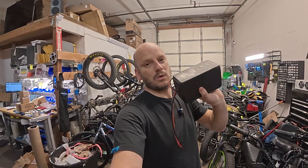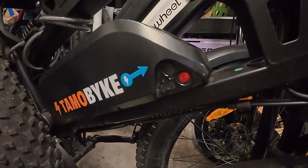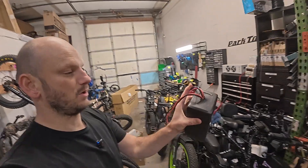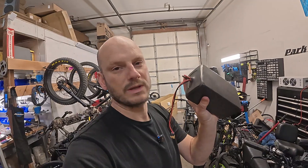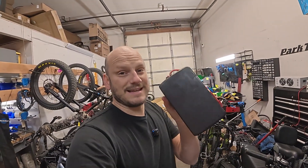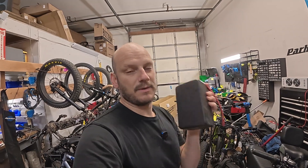These have their pros and cons. I just wanted to go over the difference between this and something that has an on/off switch. First of all, what is current inrush? Current inrush is what happens when you connect a battery to a controller while it's live. A battery like this does not have an on/off switch, so essentially this thing is always live. When you connect it to your motor, it's on — it's going to send a bunch of power to that controller regardless.